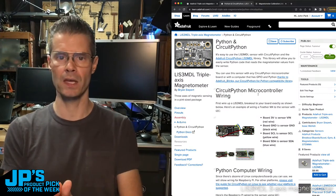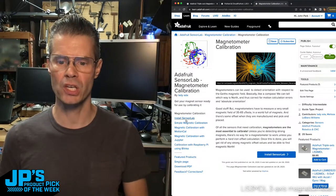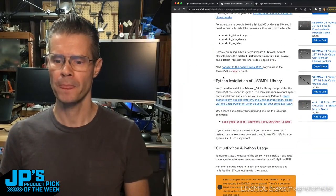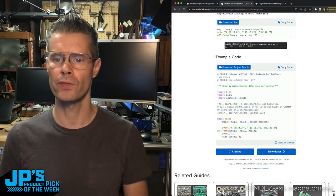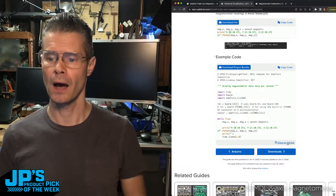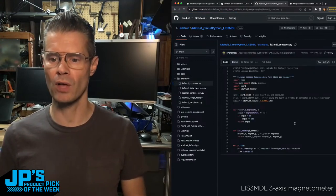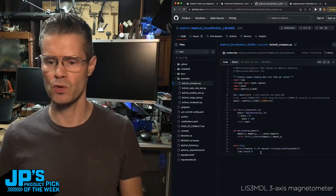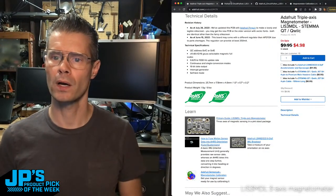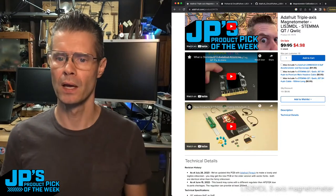Code is available. Jeff Hunt in the YouTube chat asks if the code is available. The code I'm using right now — you can use the magnetometer calibration code in Arduino here, but soon you'll also be able to do it in CircuitPython. And the actual example code I'm using, if you just look at the bottom of the learn guide CircuitPython page, that gives you some basic magnet sensing. If you go to the library on GitHub and check out the examples section — LIS3MDL compass — that's the code I'm using. On top of that, I'm also subtracting the calibration data. Pretty soon the guide will show you how to do all of that — hopefully within a week or so we'll have both the calibration code and the compass example in the main learn guide page.